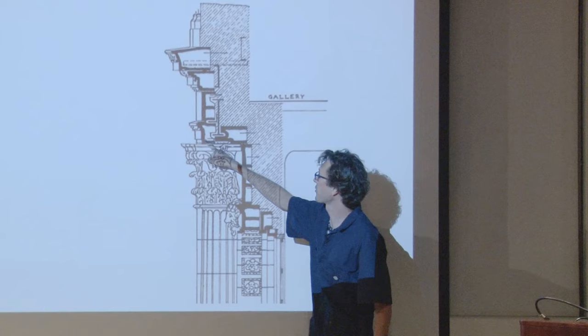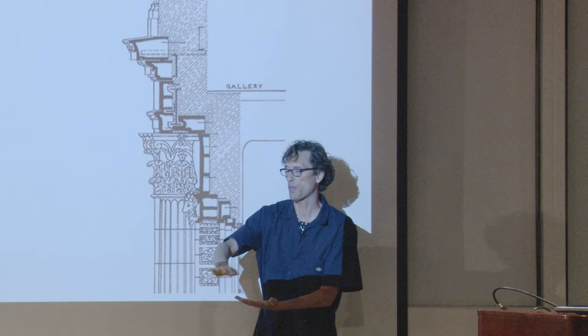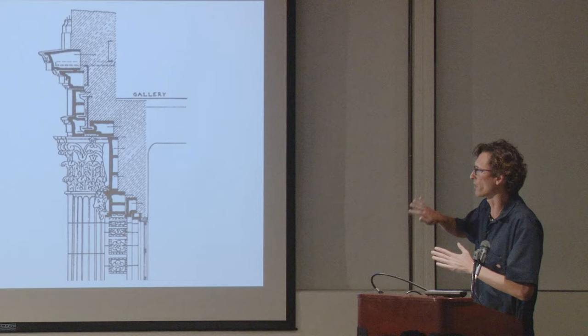All right, section through a terracotta building. You can see that these are the terracotta or the ceramic components. They're like a deformed surface, right? It almost looks like each one of those is a C shape. That's for good reason, because oftentimes you make almost like a thick blanket of clay, and you lay that into the mold, and then you beat it in when you're doing this process, press molding. So it's not quite three-dimensional. It's kind of like 2.5 dimensions. It occupies three-dimensional space, but it's still a deformed surface.